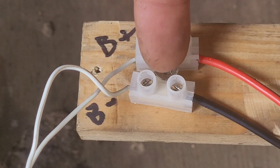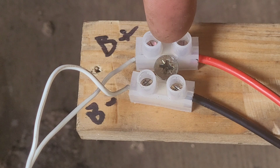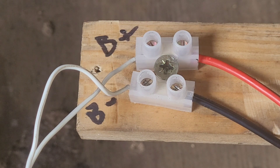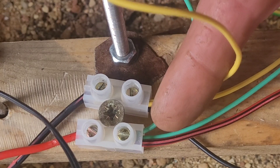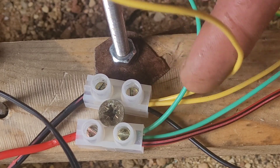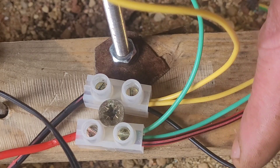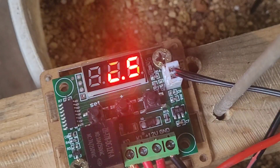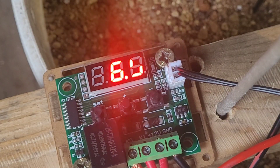At the moment I've got a lithium-ion battery running this, but the idea is, if it works, to connect it from the wind turbine, and then it's an extra load when it's windy. Everything's wired in here — the green are the two positives to the fans, the two yellows are the negatives to the fans, and then you've got the red and black for the LED strip. This will produce 10 amps apparently, so in its current form it should give an extra load to the wind turbine of about 4 amps — about 50 watts.